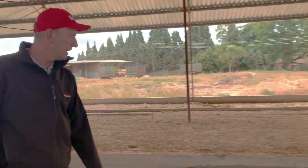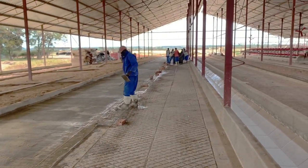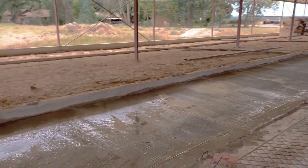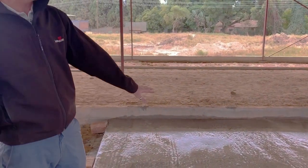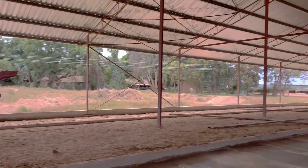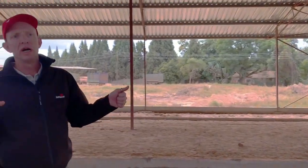What we want to show you today is this section of about 20 meters. We've cast it in four hours starting in the morning and we've just got to this point here, which you can see is still wet. We've leveled it up and now we're going to go back to the beginning — that's about four hours since it was cast — and it should be ready for us to do our imprint.